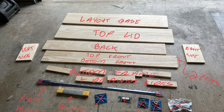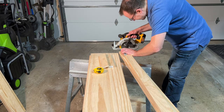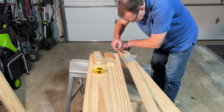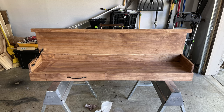Here is the same picture I showed earlier, but with notes on where each of the pieces were used, and also notes on the length and width of the pieces. Note that the exact measurements will depend on the width and thickness of your particular lumber. The top lid and main layout base were 12-inch pine, which means they were really just over 11 inches in actual width. In retrospect, it might have been better to use 3/4-inch birch plywood for the lid top and layout base in order to make it a full 12 inches wide. The top lid was a full 5 feet or 60 inches long, while the main layout base was 1.5 inches shorter to account for the thickness of the side pieces. My office desk is 60 inches long, so I wanted this layout to fit on it if I decided to operate the layout there.